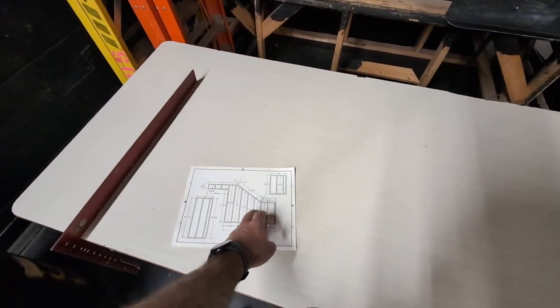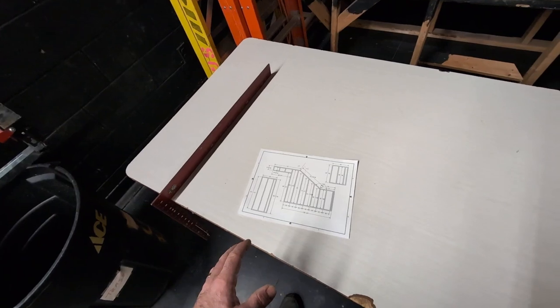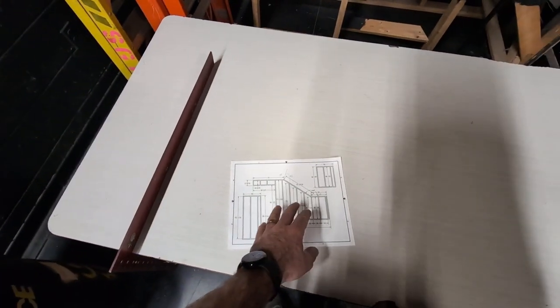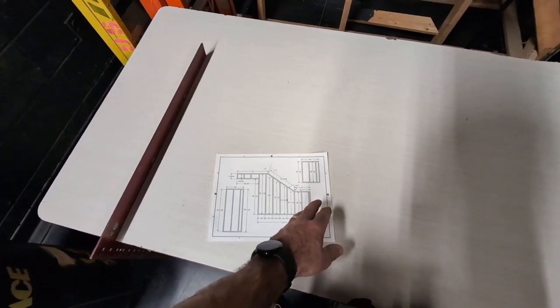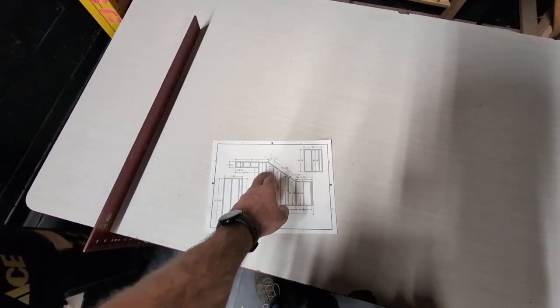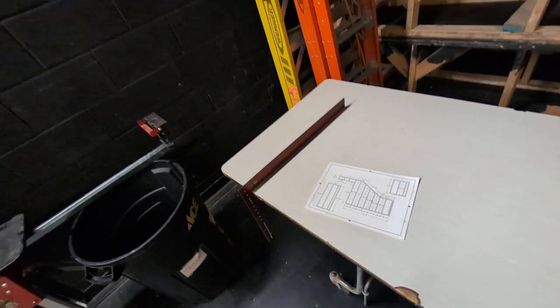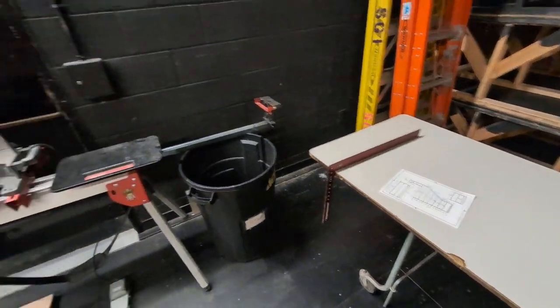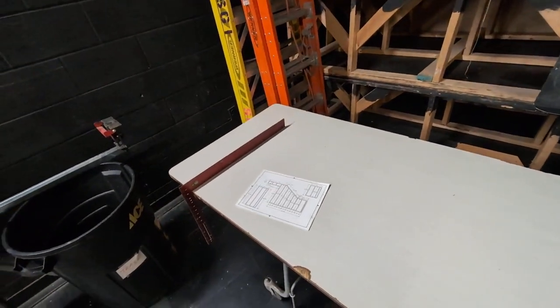But I am not going to lay out the opening in this construction when I make it, because we don't know what the chalkboard's going to be yet, how big it's going to be, where exactly it's going to be located. It will be no issue when we know for me to cut three or four of these off above and below, head them off above and below, take the pieces out that we don't need for right now, set them aside, and we'll have what we need, and it'll just be the way that we choose to work. So sometimes you know that you're going to make a change like that later.